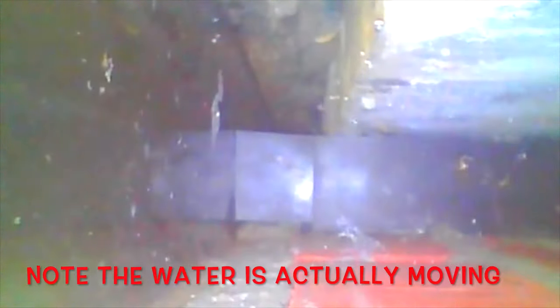The camera has just gone into the cavity — there's a wall tie, and that's the insulation. It is waterlogged, so there's actually standing water within the cavity just below the DPC. You can see the water is moving, and there is a subfloor vent also.